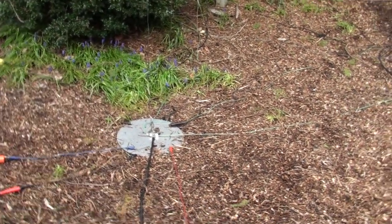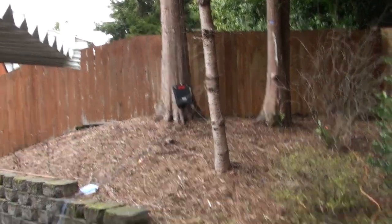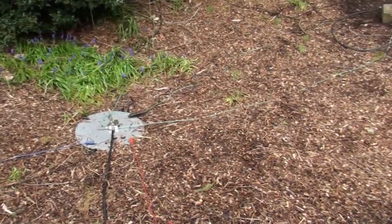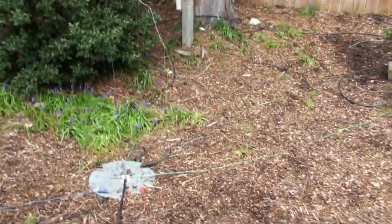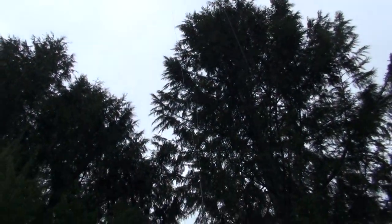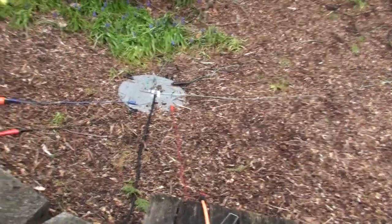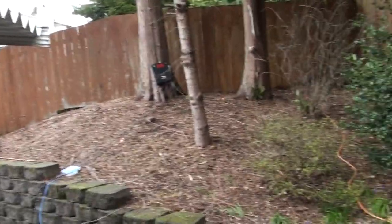When I'm doing that I still want to be on the air for 160 — I've got some friends on 160 and I don't want to lose 160, but also don't want to lose 80. Maybe when I'm restringing that I'll move that box over to the inverted L. It'd be interesting to see how that tuner works on the inverted L as opposed to a big piece of random wire. My suspicion is it may not work, maybe I'll get a tune on 80. Definitely this seems to work okay for 160 — not the best SWR — but I am going to build a tuner, and this looks like a viable antenna.